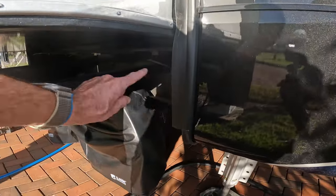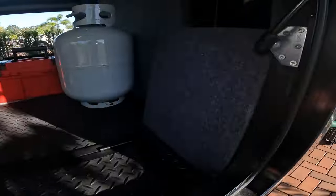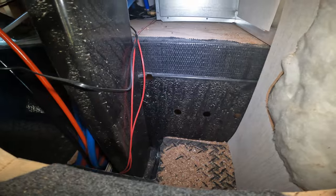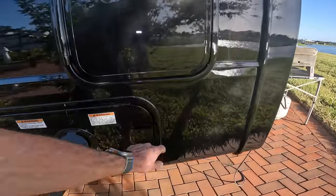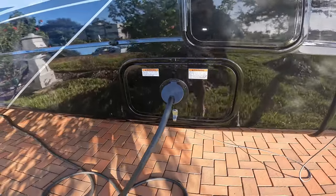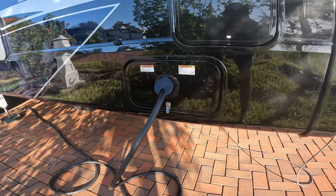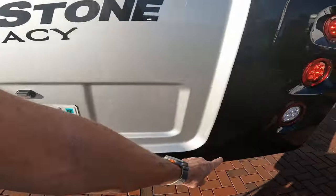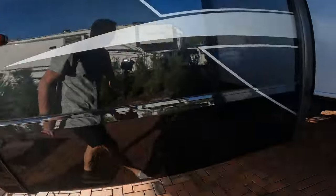I'd bring it down, run it across, and bring it up all the way through, coming up here through one of these openings with a rubber grommet, then run the cable in and house the router in there. I had a little concern about bringing that shielded twisted pair across the power wiring — I was afraid of some EMI. I don't really think it would be a big deal since shielded twisted pair should prevent interference, but to be safe I've decided to run the cable on this side instead, which has proven to be more challenging.